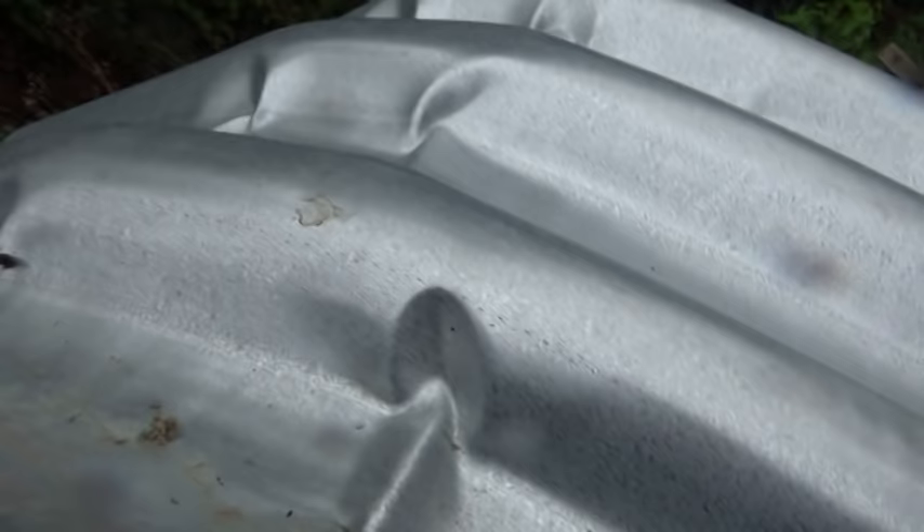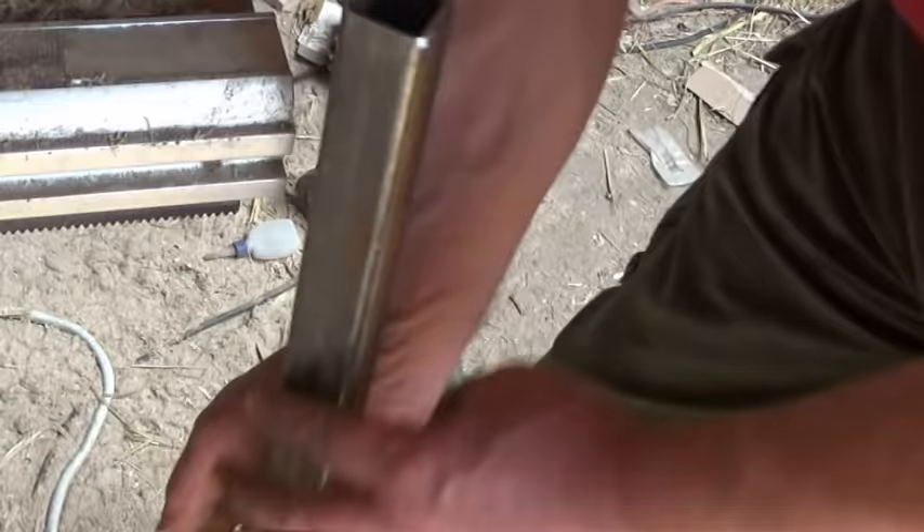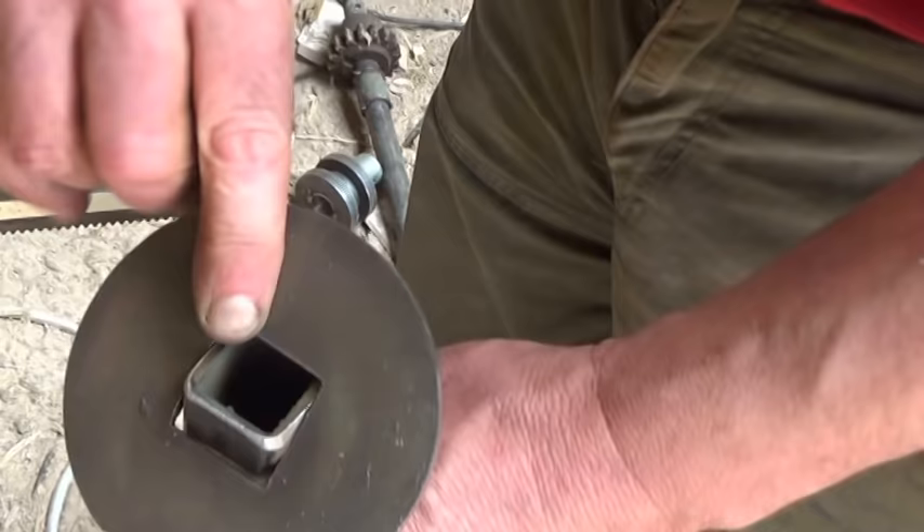As you can see in these examples, the steel on the outer curve is stretched and smooth, but the steel that's supposed to contract has simply buckled. So that was the problem.